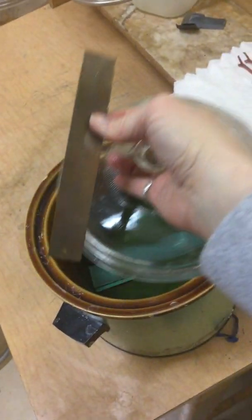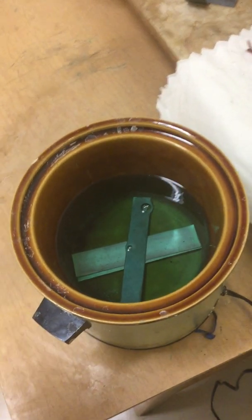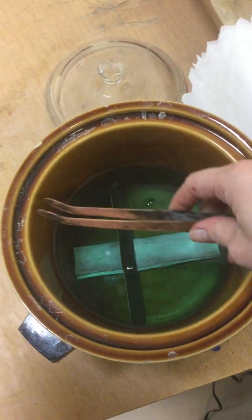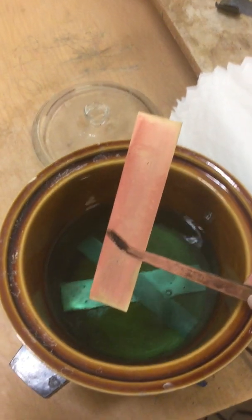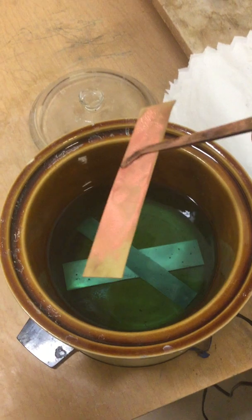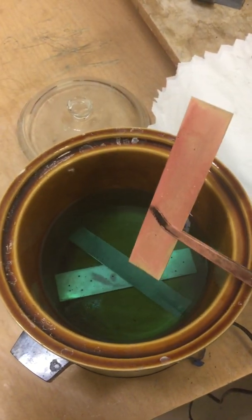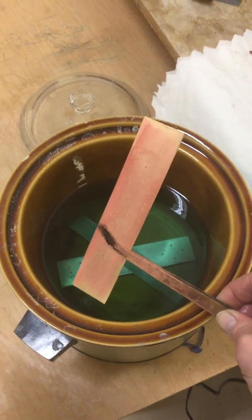This is the pickle pot. The pickle pot is not soup. It is this metal here inside the pickle pot, and it's kind of greenish because there's a bunch of copper oxides in there. That's from the fire scale — the stuff that builds up on your metal when you heat it up. So you put it in here because it's kind of brownish and gross, and that's fire scale. You want to get that off. Like any good cooking show, I have a piece of metal that is completely pickled. It is clean, but it's brass and it has a copper scale on it.